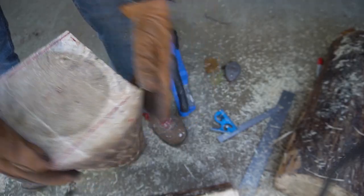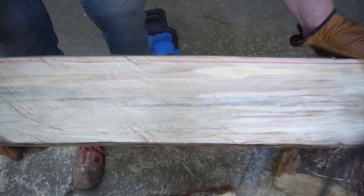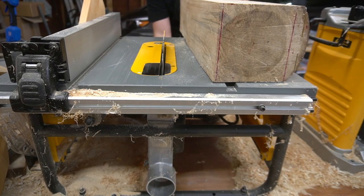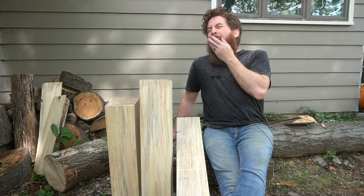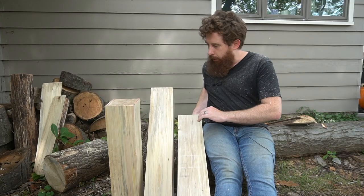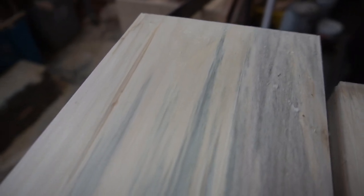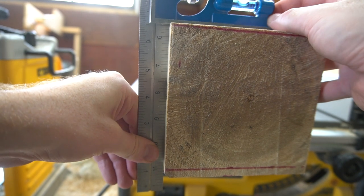It's somewhat square — looky there. Now I can run that through my planer, get one side somewhat flat, and run it through the table saw. Bam, we're ready to go. I got these run through the table saw and through the planer and they're looking pretty good. I really like the grain that's appearing here. These colors are super fascinating — there's pinks and browns and yellows. It's just crazy looking wood and I love it. They're pretty square right now, I just have a little bit of fine tuning to do.